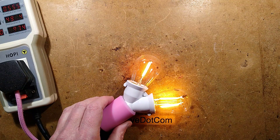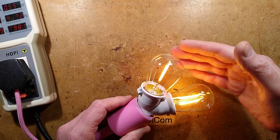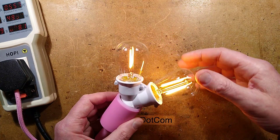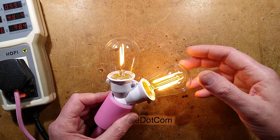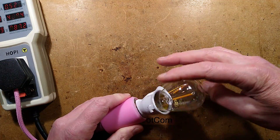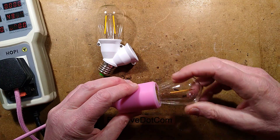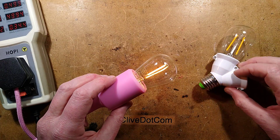Let's take a look at a 1 watt festoon lamp. This is a 2 watt one I looked at previously, and this is the new 1 watt one. Compared to the 2 watt, it doesn't look half the intensity - it looks about a quarter of the intensity. It's much dimmer. But it does have a notable advantage: there's no flicker off this one, whereas the 2 watt has a slight shimmer. It's a very dim, comfortable-to-look-at type of filament.